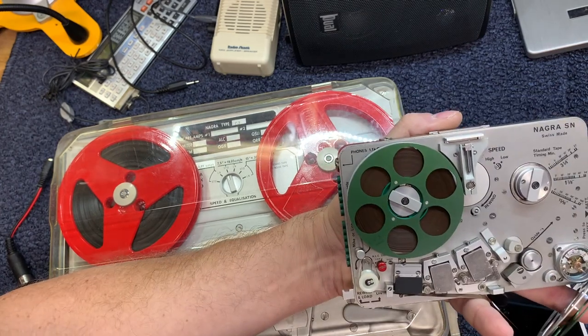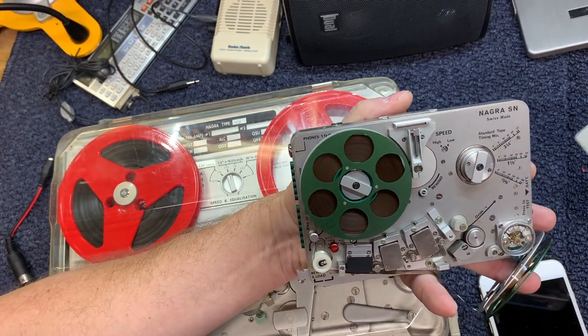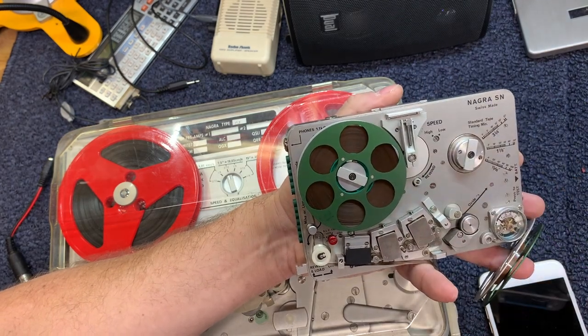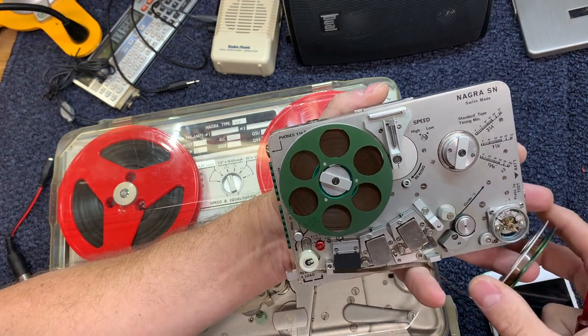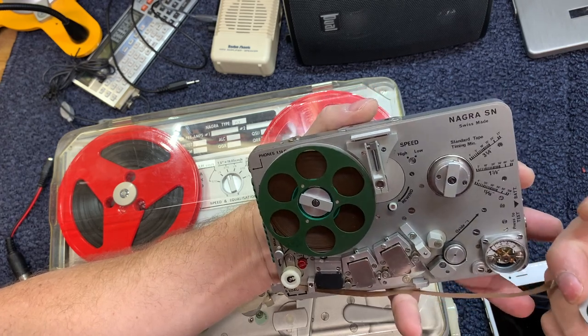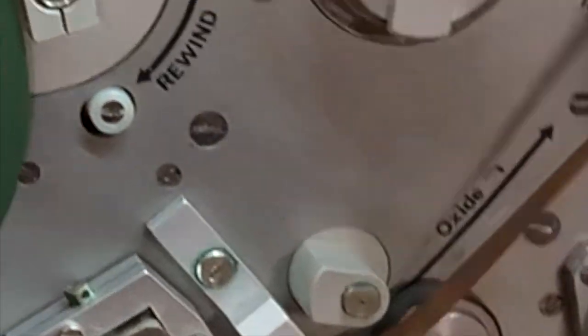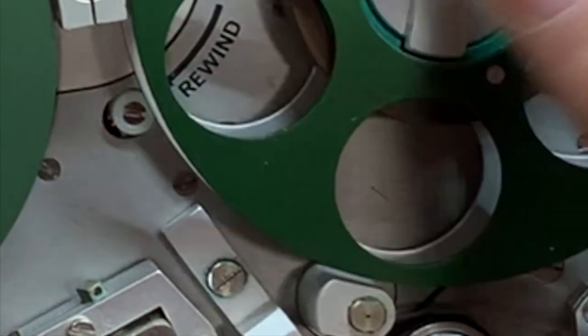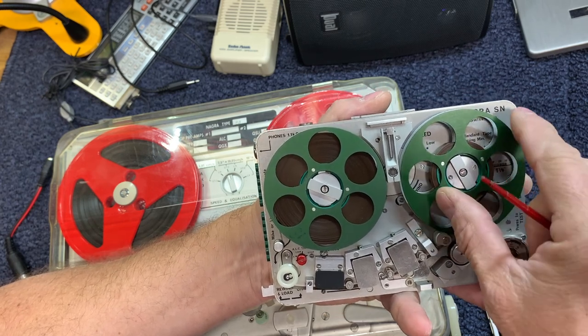Another interesting thing that I want to show you is a video clip. I recorded a video of some of these tapes, using some of these bonus tapes, I'll call them, and I noticed the recording was very poor. Then I began to notice the oxide coating. I'm going to look a little closer and zoom in on this tape right here, draped across my fingers. That dull finish is the oxide coating on the vinyl or plastic or whatever this tape material is made of, and that's what the magnetic particles are bound to.